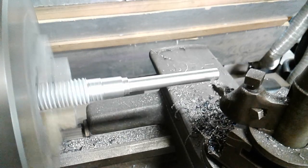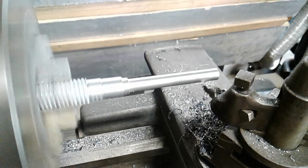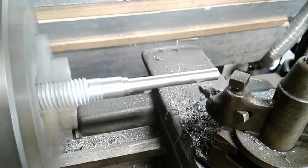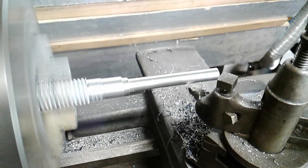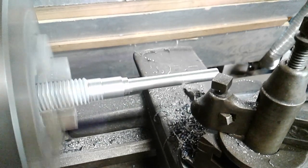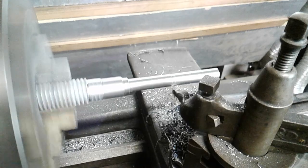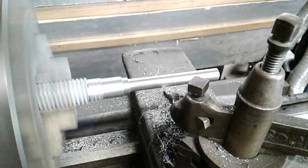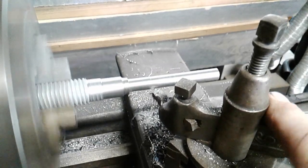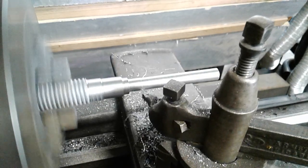I can always order new tooling. I'm going to order a quick-change setup for it and some new cutters and we should be in business. The only other thing I need to order is a live center for the tailstock. I thought I saw one in the picture but it wasn't there. The lathe came with a three-jaw and a four-jaw chuck, two drill chucks for the tailstock, and a bunch of these old-school cutter holders. But I'm going to change this out to a quick-change setup. A fresh blade on it might do better.